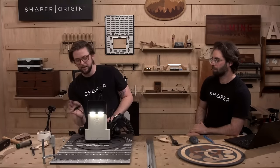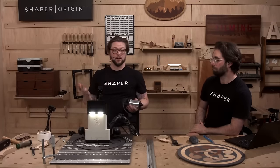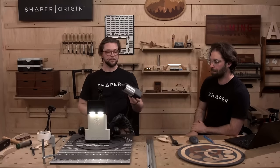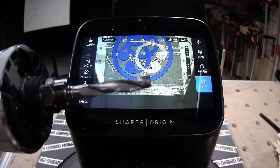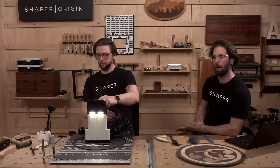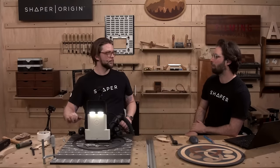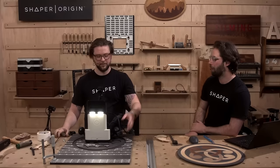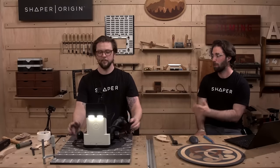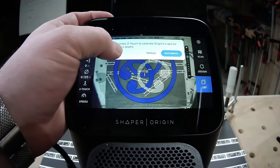I'm going to pop out this eighth inch bit, get something a little bigger so pocketing goes faster. Yeah, cool thing about this project is that these inlay parts have kind of sharpish corners, but the pocket part itself actually has no sharp corners. It has sharp positive corners, but not sharp convex or concave corner would be the negative corner, right? Yeah. So no sharp negative corners. So you can clear this out with basically as big of a router bit as will fit. So we've got a big 8mm router bit in here, and that's going to clear this out really nicely.